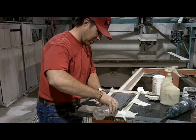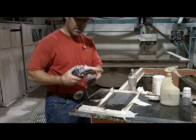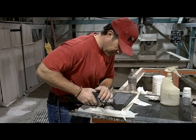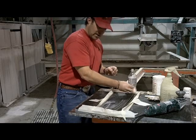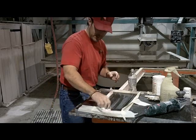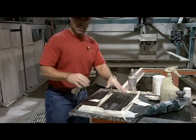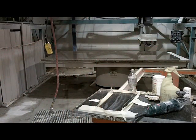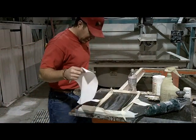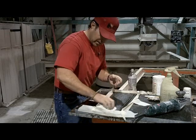I can do one of two things — we'll go ahead and try to touch that up. The lesson here is: if you leave a 200 grit scratch, it's not going to come out with the 500, and it's not going to come out with the 1000. We're going to clean this up, and cleaning is pretty important. When using 500 grit diamond, you've got 500 grit diamonds coming off in the process. If you don't clean the surface really well between the 500 and the 1000, you're still going to have 500 grit diamonds on there and your polish just won't be that good. Slow down, clean everything up, and you will get a better result.